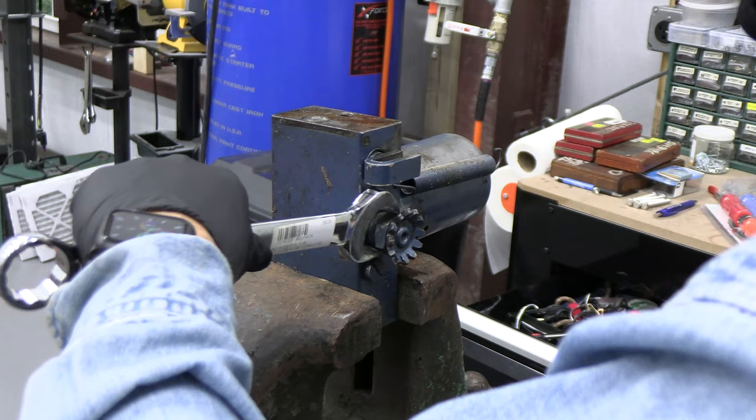This is an oil seal, an oil sweep, which I took out with a screwdriver, and then we just reseated the new one with this 3/4 inch socket. It fit perfectly. So I'm going to put our ball bearing back, put our two copper washers, this back, and again this has a 29 millimeter socket. We'll just tighten that up. I'll put that on the vise and really tighten that up.